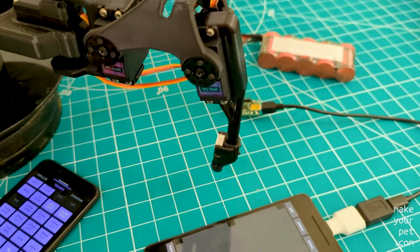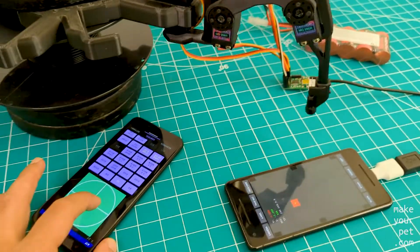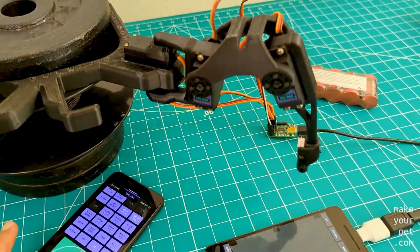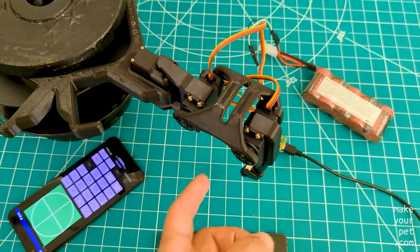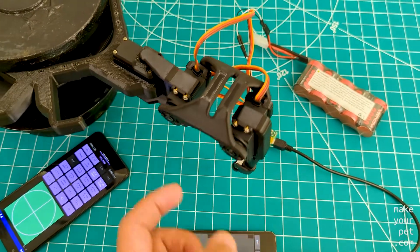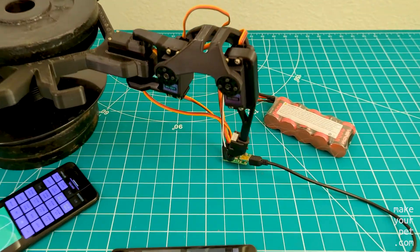But as you can see, the leg movements aren't smooth at all. It seems the servos are constantly overshooting. Also, it got worse over time and is happening on two servos out of the four. So it seems like these servos are not going to work, and I have to keep looking for other cheap servos to try in the future.